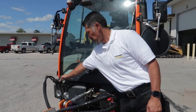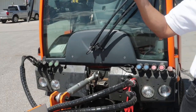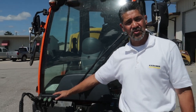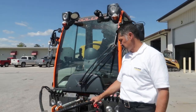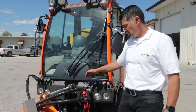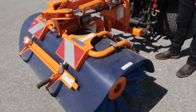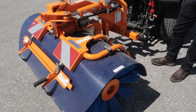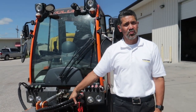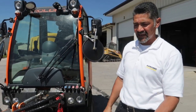The hydraulic circuits are all color-coded, so you have your black couplers, your green ones, and your blue ones. Those correspond to the joystick, so they're all controllable for whatever attachment you have connected. You also have your low flow, which puts out 35 liters per minute, and your high flow — the rotary broom right now is connected to the high flow. Both the 35 and the 70 liters per minute are completely variable and adjustable from within the cab, and the high flow boosts with your engine RPMs, so you can adjust it as needed from within the cab.